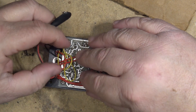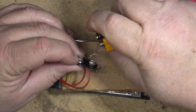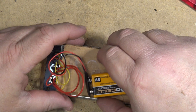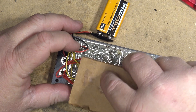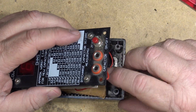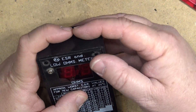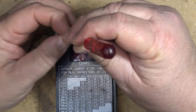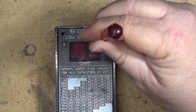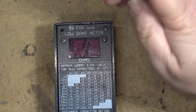This just goes on like that, the 9-volt battery clips on, and this just prevents the 9-volt battery from causing a short circuit. I think I actually had these tucked in below before. Anyway, that's what it looks like. It displays 'EA' when it's turned on, and then you just zero it out by shorting the leads together every time you turn it on — that takes out any resistance on the leads, which is good for measuring capacitors. I just thought maybe some of you guys might be interested in seeing what the inside of that little home-built meter looks like.